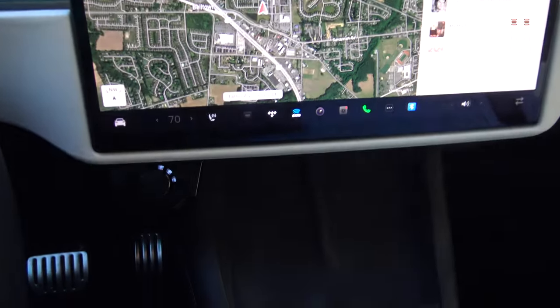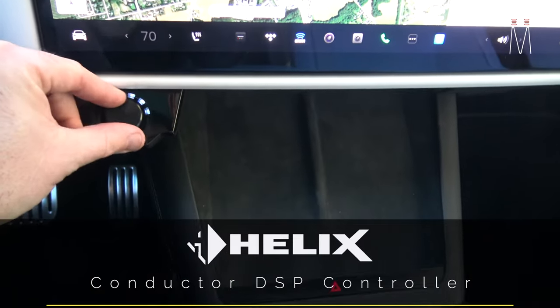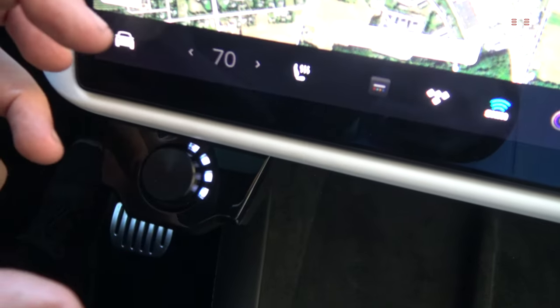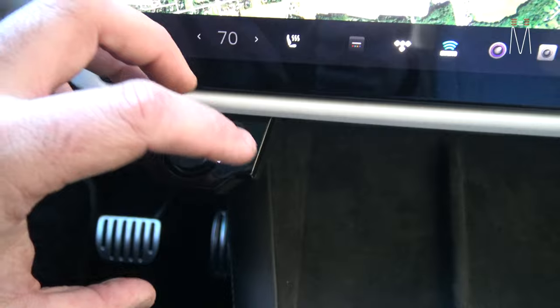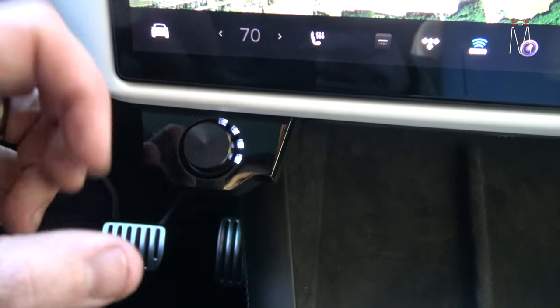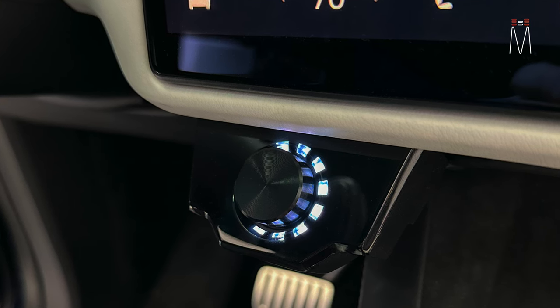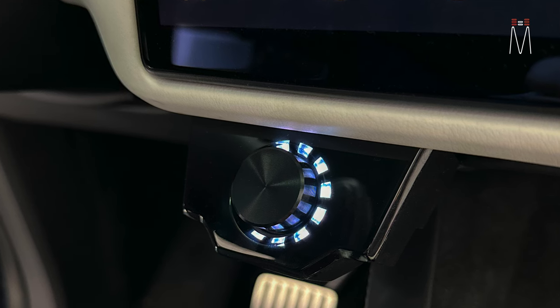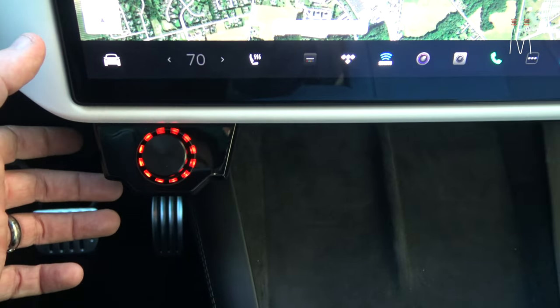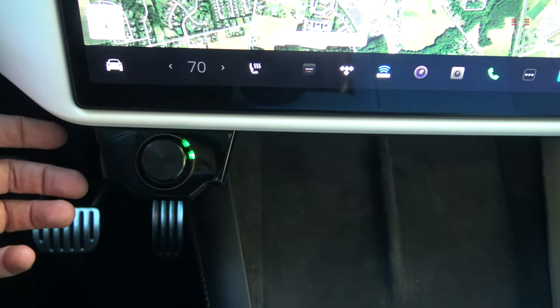As far as the DSP, we're using the Helix V12 in the back. This is the Conductor, which you see us use quite frequently. We made a mount and affixed it to the bottom, very sturdy. Essentially the whole face is smoked acrylic, so the LEDs are illuminating through the smoked acrylic — you're not physically seeing any part of the Conductor knob itself. There's a nice chamfer on the inner side of the smoked acrylic giving a really cool effect. These LED lights represent the master volume of the DSP. Hit it once — that's the subwoofer volume. Hit it again — that's the preset you're on.